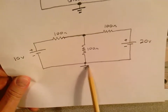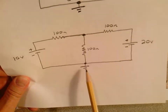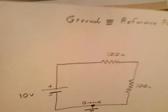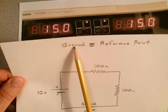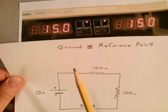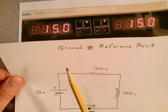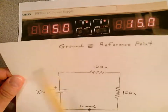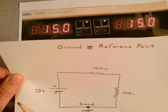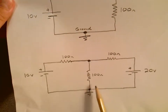That floating ground means this reference point is not tied to earth. Keep in mind: when instructors talk about grounds in your courses, don't always think of earth ground — it's just a reference point to measure voltage, synonymous with a reference point. Like talking about a car going 50 miles per hour, that reference is earth ground, but in electronic circuits the reference point doesn't have to be earth ground all the time. Sometimes it can float, like in this circuit where we don't use earth ground.